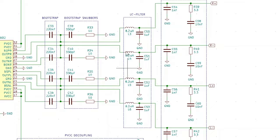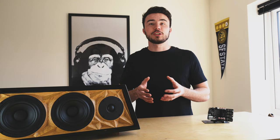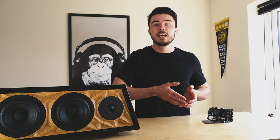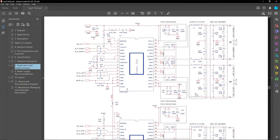Finally we have the LC low pass filter. This consists of the inductor (L) and a capacitor (C), which takes our amplified PWM square wave signal and filters it back into a sinusoidal audio signal we can send to the speakers. Depending on the impedance — essentially the resistance — of your speakers, the values of these components will change. This is why I deviated from the reference circuit, which is designed for 4 ohm speakers. The equation to calculate LC filters is linked below — it's simply a case of plugging in your values.